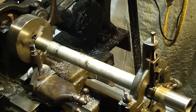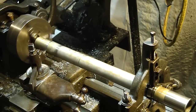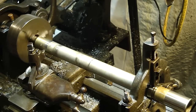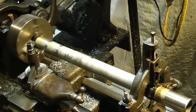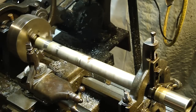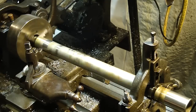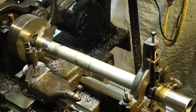Another five thousandths — so I know that is actually five thousandths there. I could probably go a little faster, but every time I go over 16 hertz that's when the vibration was induced. I'd rather go low and slow here, not wreck the machine. I don't need to speed this thing up — for me this is adequate, this is all I'm really after, just to get the job done. You can hear it starting — it wants to start those harmonics but it's just below the speed where they can really get a good cycle going between the tool posts and everything else. That variable speed frequency drive is definitely a plus, and that's a pretty quiet running lathe. I got it dialed in pretty well here. Alright guys, take it easy.